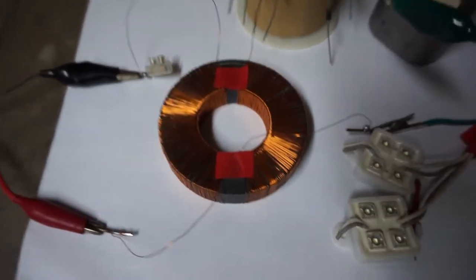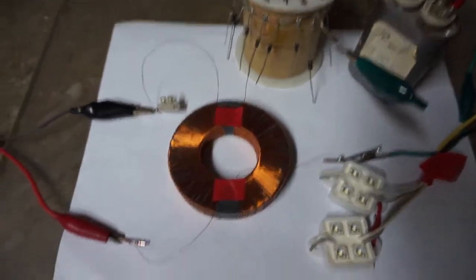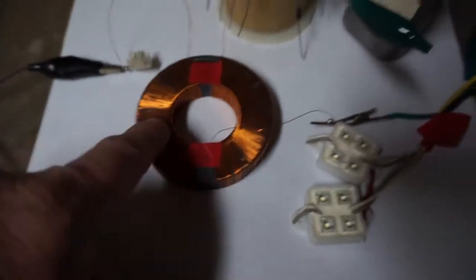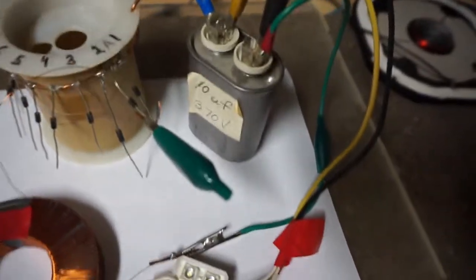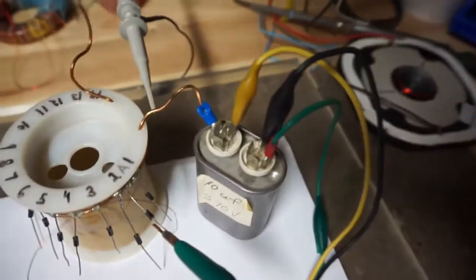What I want to know is the coupling ability of two coils — one being pulsed by this pulse generator and the other coil going to this diode carousel with a capacitor. The other side of the capacitor is connected here, and then I have these LEDs connected right onto the capacitor over there.